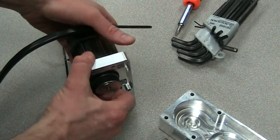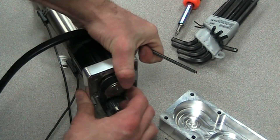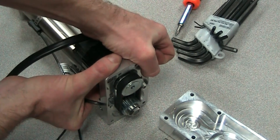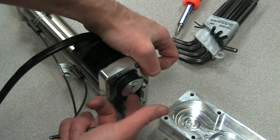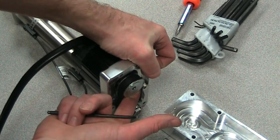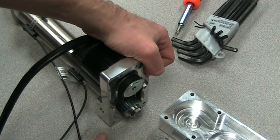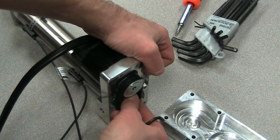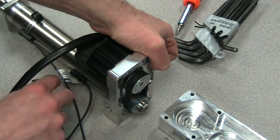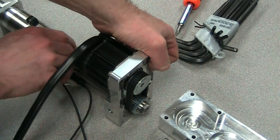You can see as I pull on this, it's going to tension that belt. We want to load this up to about 10 to 15 pounds of force on this size. What people have done in the past is use a scale — like a fish scale — to pull on this upper motor pulley and actually set that tension. In our manufacturing facility, we actually use a tool that separates the two pulleys and sets it to a certain tension.